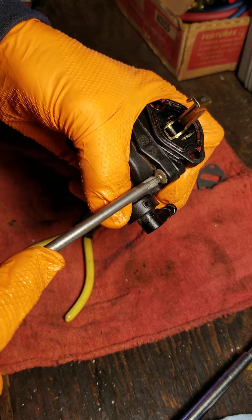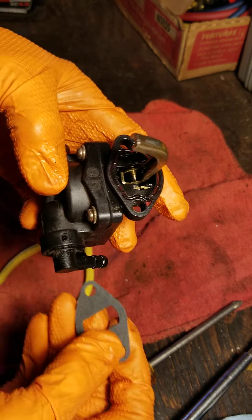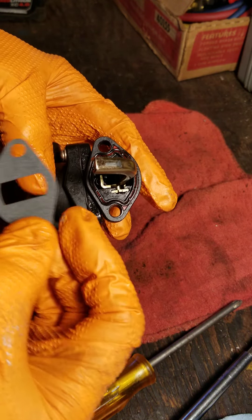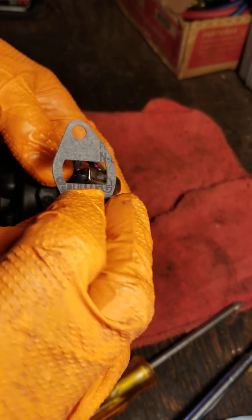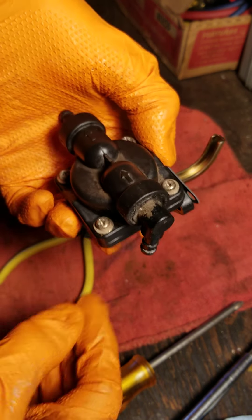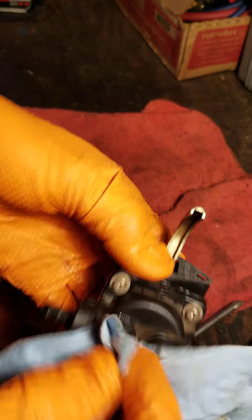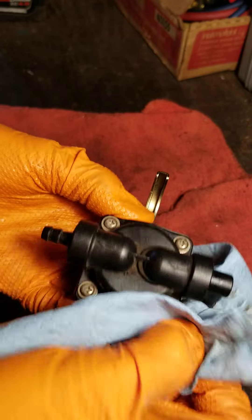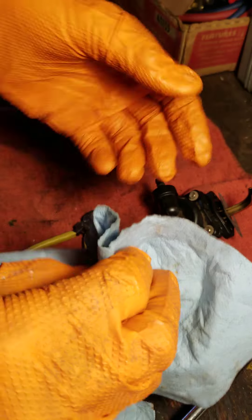This thing went back together no problem. I'm going to put it back on the compressor with a new gasket — I'll clean up the mating surface, and since there's going to be oil on that side, we'll put just a little bit of silicone on there. It'll go back on the compressor probably tomorrow morning when it stops raining, because we don't like working in the rain — it's supposed to be the sunshine state.